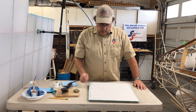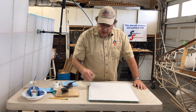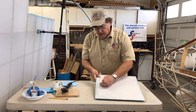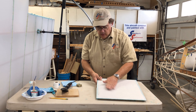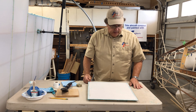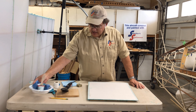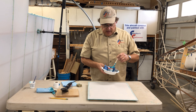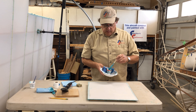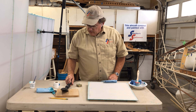We're going to bond the fabric to the surface of the plywood — all shrinking is done, no bubbles. I brought out one of our glue erasers: if you have any areas with globs of glue heavier than you like, just rub with the glue eraser and it'll take it right off. Don't worry if you see a little green — we're going to be sealing that anyway. I'm applying the glue now to adhere the fabric to the plywood so there won't be any issues with lifting or bubbles. It's about 85 degrees in here so I've thinned the glue just a little bit — you can add about 10% water.